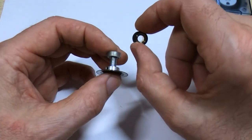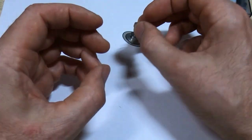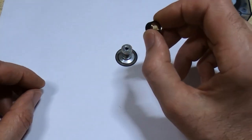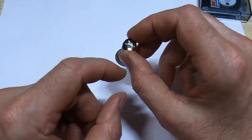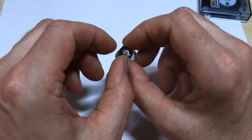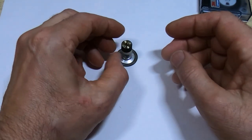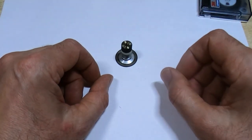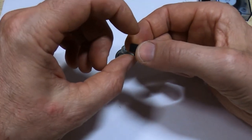I've already made the pinch roller I intend to use and it's the correct size, so it will sit in the correct relative location and all I need to do now is machine this down so that the top section is the right diameter for the bore in our pinch roller. This approach gives me a lot more control over the final product — for example, if I want something slightly softer I can use a smaller core and keep more rubber for a thicker rubber section. The size I ended up with was the same diameter used for the original roller repair, with a width of 6.6 millimeters, which gives the correct height and will work for both types of tape.